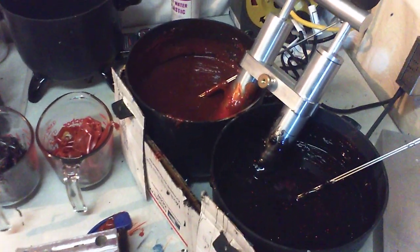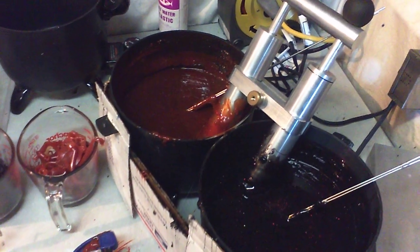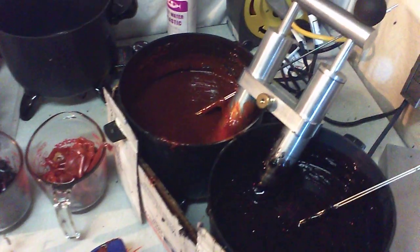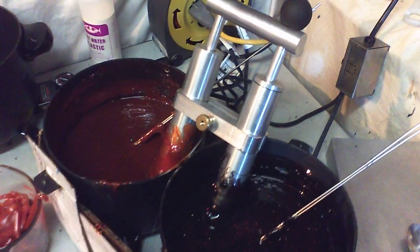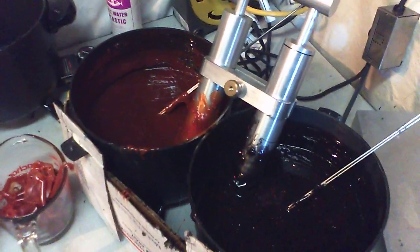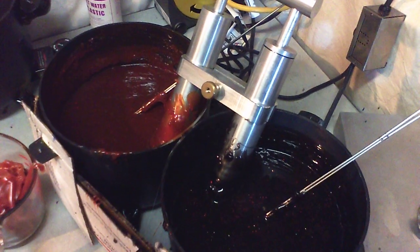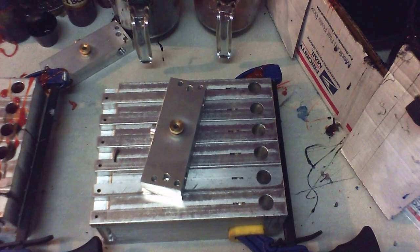Okay, here's the way that I do some production type work. I leave the twinjectors in there. These are actually the large twinjectors and two presto pots that have the hot plastic in it already. I've got the two colors, so these are going to be laminates, of course. And I've got the mold set up over here with the blending block.